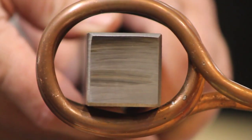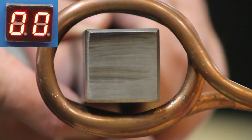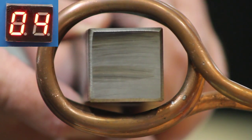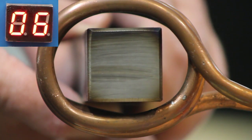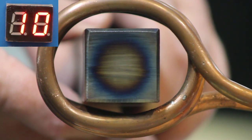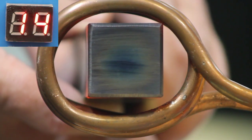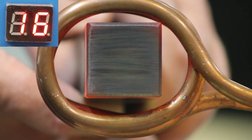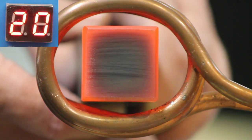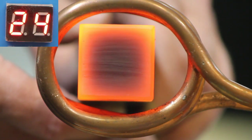I should have gotten a fire brick to prop this on - it's more relaxing for the smith and cuts down on sparks. Now, watch the colors run on this. The colors are building from the outside and then coming to the inside. That heat effect is actually all the way through the stock in the coil, and the same thing is happening as we're reaching incandescence. The heat is going to come from the outside and go to the inside. That's a skin effect.